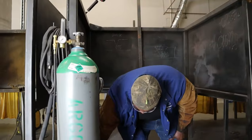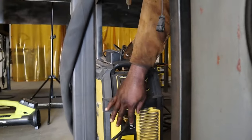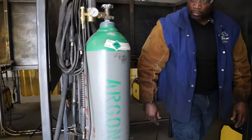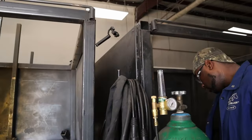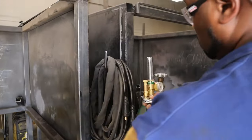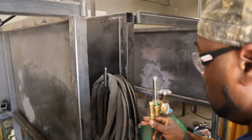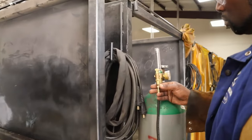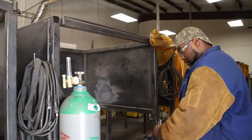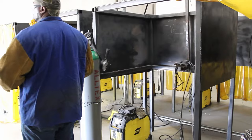At the very end, you disconnect the hoses for your gas — the hoses that connect the adapter to the gas tank. You want to disconnect this here as well. Once you have this disconnected, you're pretty much all set. You have everything disconnected from your TIG torch.